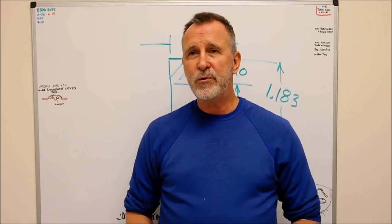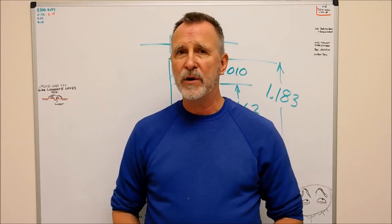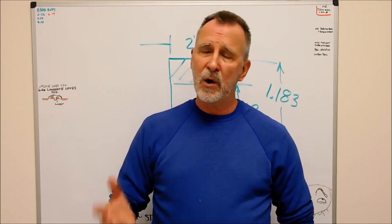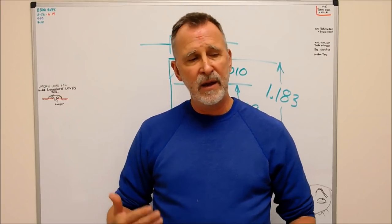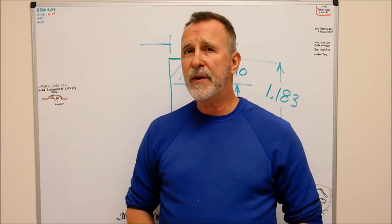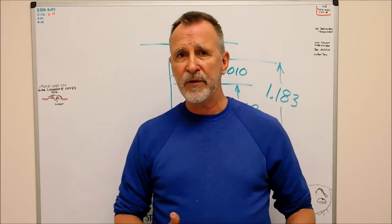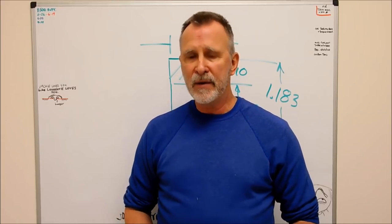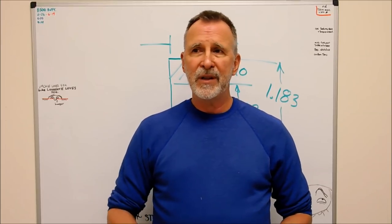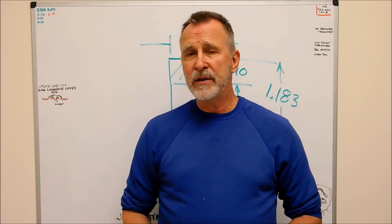Okay, well I hope that you got something out of that. That is a great technique for making exceptionally thin wall parts on a lathe. Make sure that you do the inside first, keep the chips away from the tool when you're doing the outside, have all your numbers, everything should work well for you. Naturally, the philosophy behind that is what I wanted to show you, not necessarily the starting size or the depth of cut. It all varies depending on the material, the rigidity of your machine, the type of tools that you use. But to see it done once, you can say, hey, okay, one shot will do it. So try it out.